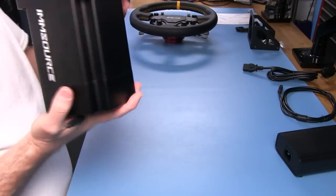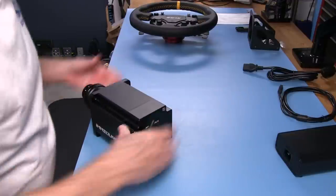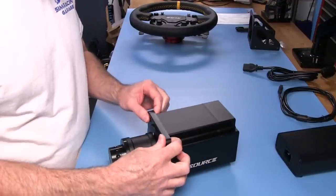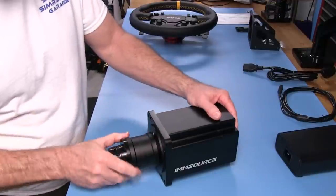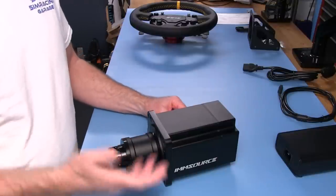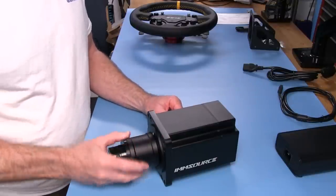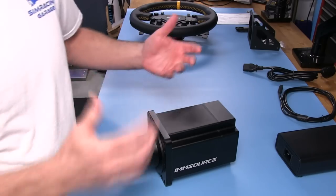What else can we talk about? Not a whole lot here going on. The flange up front here is a 12 millimeter thick flange. So it should have plenty of strength for mounting this, especially at only 10 newton meters of torque being used here. Very smooth when it's on the bench as far as turning it, which is really not an indication of a good or bad setup, to be honest. I've actually had stuff on here that was notchy, but when I ran it, it felt pretty good. Another way around, I couldn't feel anything that was notchy when I turned it on.